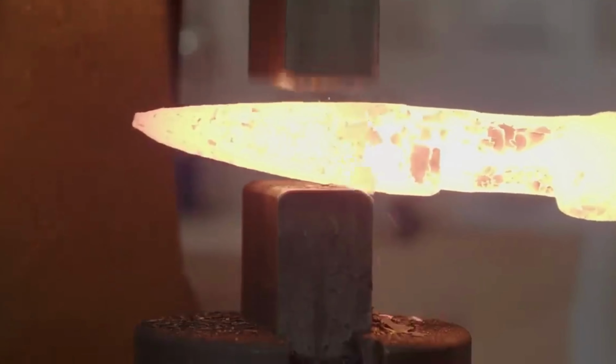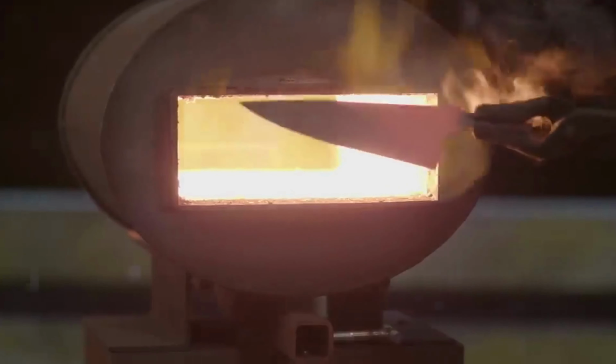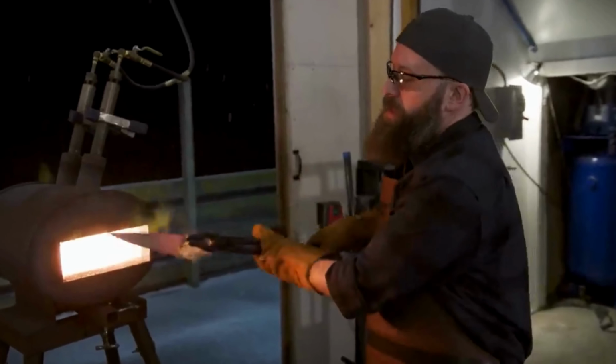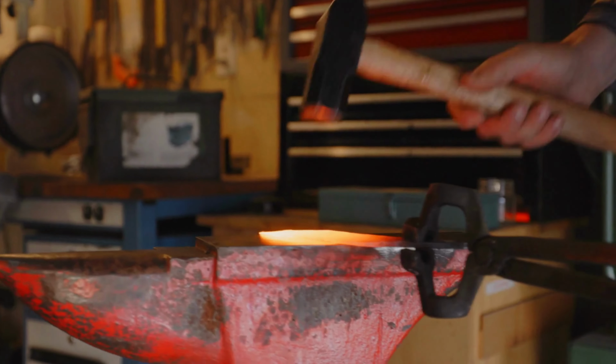Next, it must undergo metallurgical transformation in heat treatment, particularly in the hardening phase. Without this, the object might resemble a knife visually but lack its functional traits: no edge retention, no sharpness. Hence, heat treatment is a pivotal process, shaping metallurgy and thus the knife's performance. The decisive step, however, is the quenching. Success or failure hinges on it. Blades might crack or warp fatally during this stage.